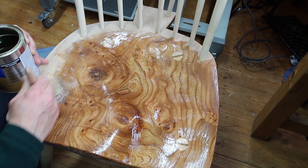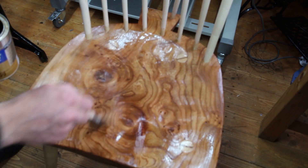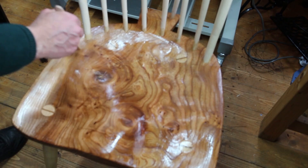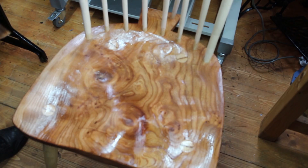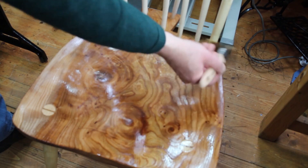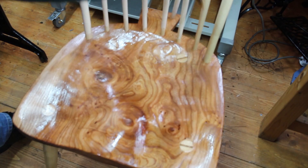So I'll carry on and get some varnish on, and I'll let this dry in my leather working shop here because it's not quite so dusty as my wood shop. It all looks rather shiny at the moment but this varnish will sink into the wood, and when it does dry it is also a satin finish so it's like a dull shine. A bit of beeswax on top when I finish giving it its numerous coats will actually just give it a nice natural — more like a French polish type of lustre. I'm keeping the wood natural because it goes a bit darker with age. I could stain it sort of brown but most of my other bits of furniture I've kept in a fairly natural state and I quite like it personally, but I appreciate these things are down to personal preference.